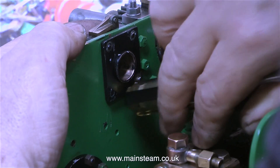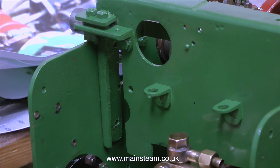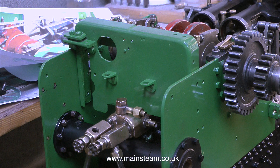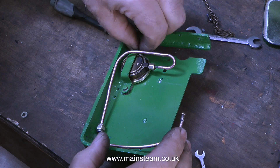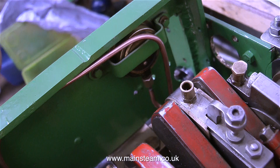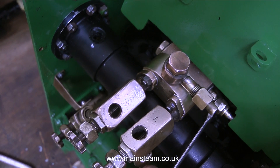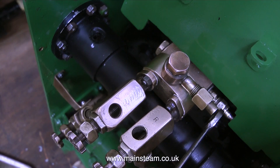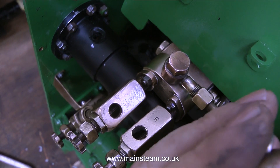When I refitted the main bearing for the water pump drive I felt it could do with some more support on the inside of the frame, but I didn't realize that this had to fit on it, so I've removed the plate. The good news is once I cut down the part that I made it's still going to fit in place later on. The first thing to fit is the pressure gauge, which is clamped in position on this shaped green part. I'm not very familiar with traction engine terminology, but looking at the photographs quite a lot of bits fit to this shaped green part. I'm taking no chances — I'm tightening the pressure gauge union before I bolt the green part in position, because once it's in position the space in certain areas of the traction engine becomes very restricted.